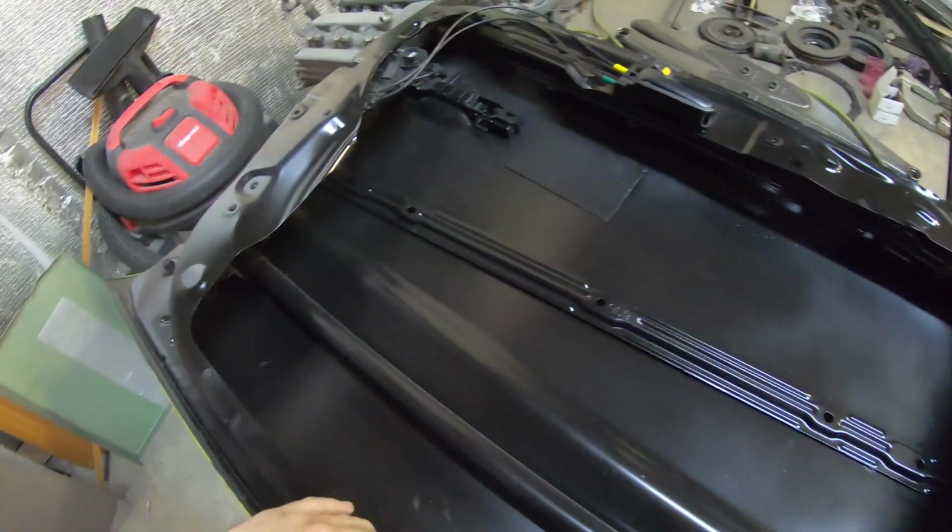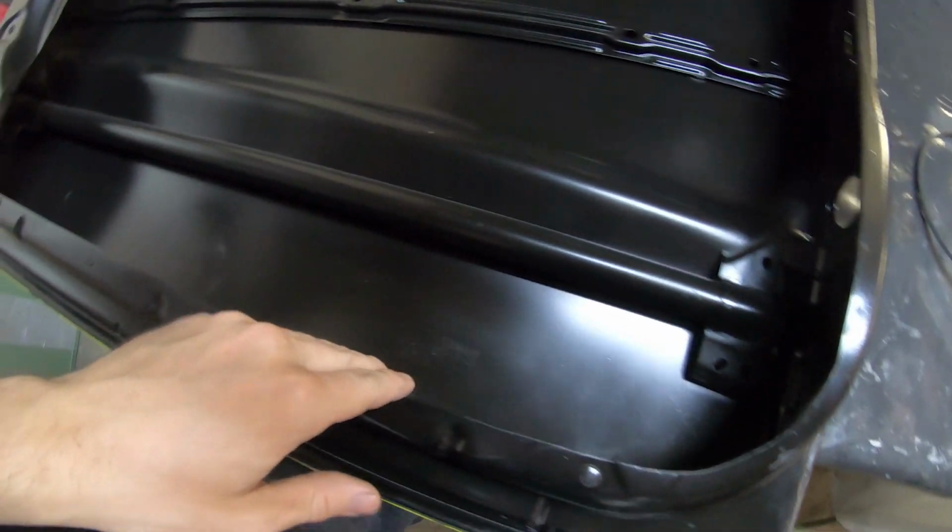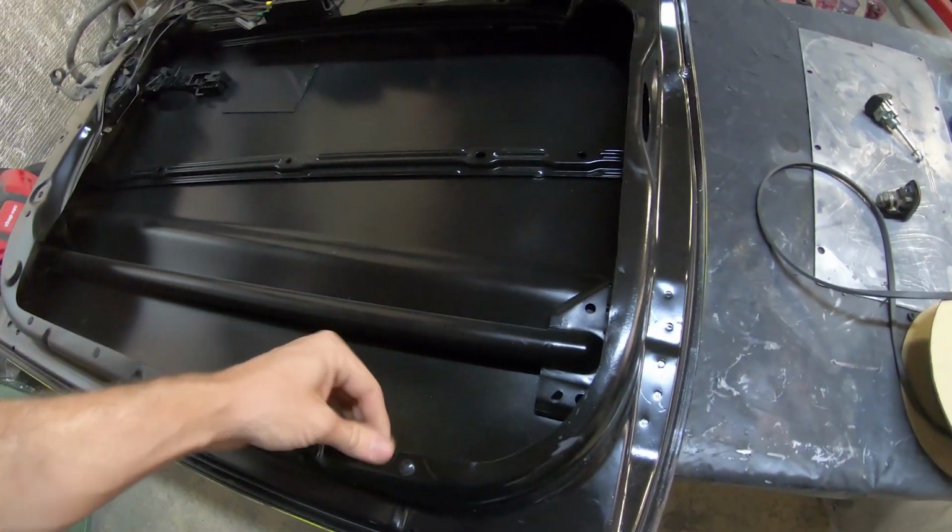We're at the last modification on the doors. We've talked about rubber edging in the past on some of the build videos. It's really nice. Still want to clean the edges up really well. So on here, we'll go to 120 grit on the grinder and get it to where you can run your hand across it on both sides. I actually like to, it's a little bit dangerous. You gotta wear gloves and be really careful when you're doing it. It does work really well.